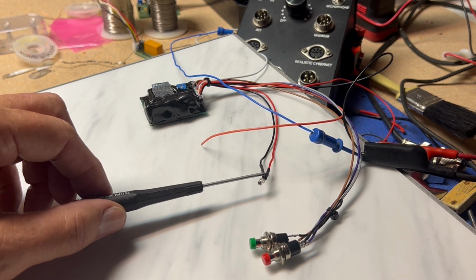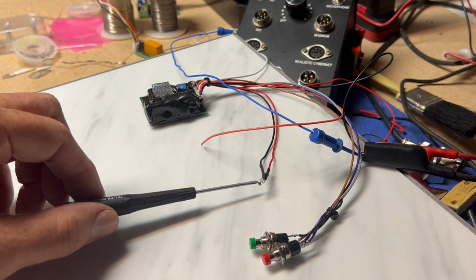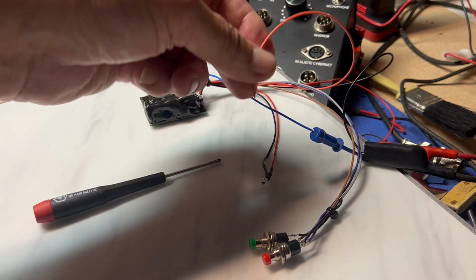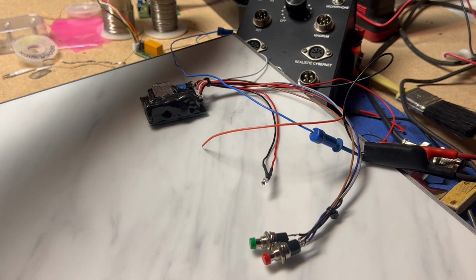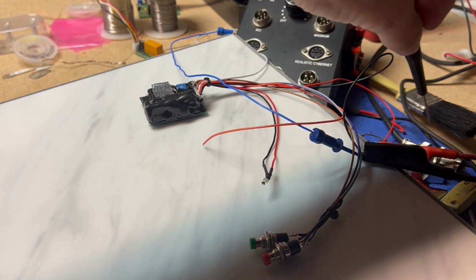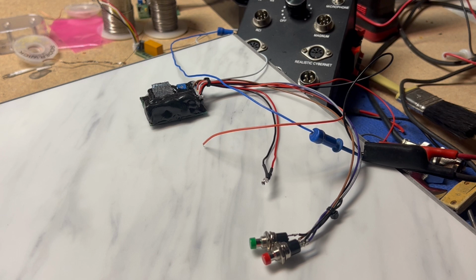That is your option. You can leave it floating inside, just tie it off, or you can mount that little LED. That would go to pin 3, the orange wire. I'm using this test speaker here, so white is going right into the speaker. Then you just have ground and plus, and that's it, 8 to 12 volts, and this will run. And it's got about 35 train sounds, boat sounds, and fog horns.